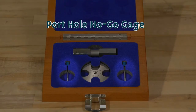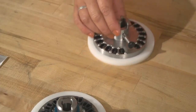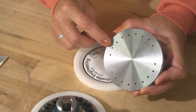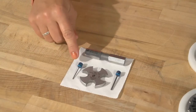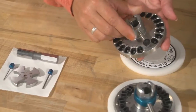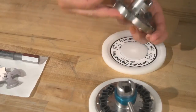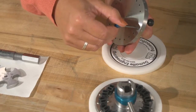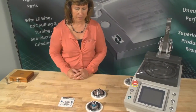Step 4: The Porthole No-Go Gauge. The Porthole No-Go Gauge measures the natural deterioration that occurs when the connectors or fiber have been mounted to the fixture repeatedly. Over time, the resulting friction will cause the holes to enlarge. The Porthole No-Go Gauge comes in two sizes: 1.25 mm and 2.5 mm. These measurements cover most fiber optic configurations. Determine which diameter is needed and gently insert the pin into the fixture porthole, checking top and bottom and in multiple locations due to the possibility of an uneven wear pattern. Ensure all holes are thoroughly measured. If the Porthole No-Go Gauge fits into a hole, the fixture needs to be replaced.